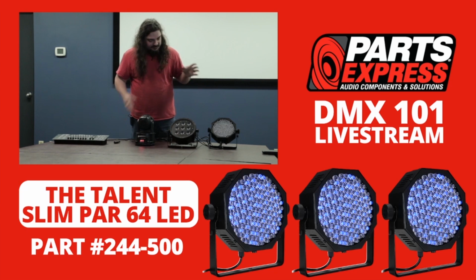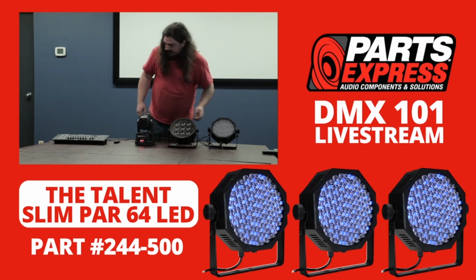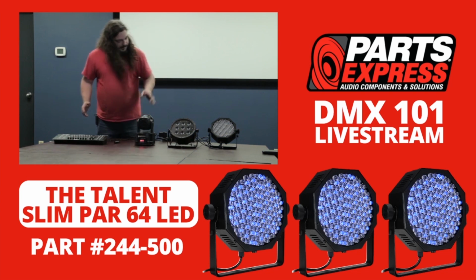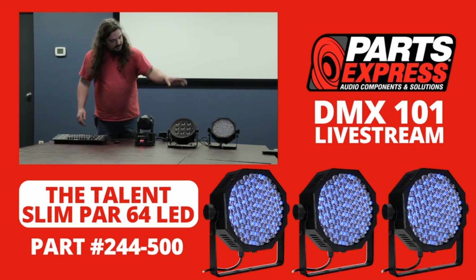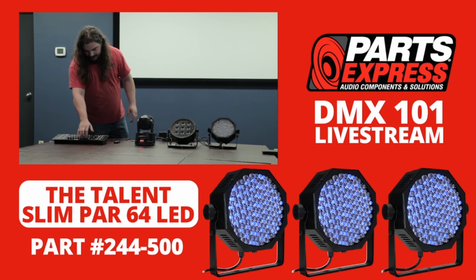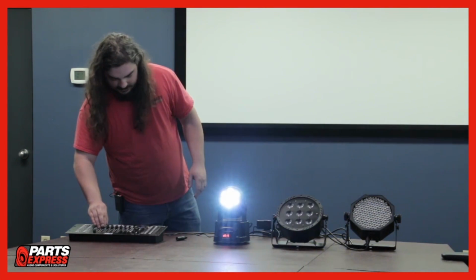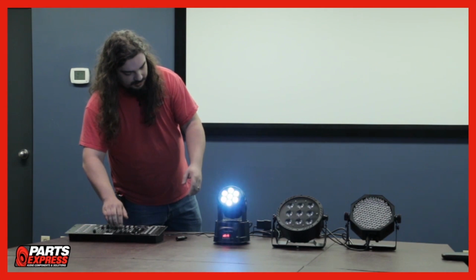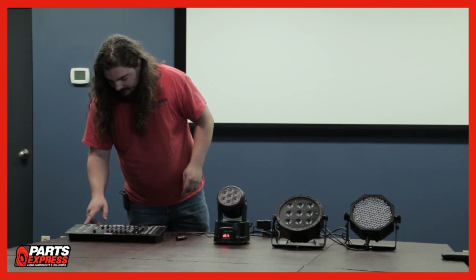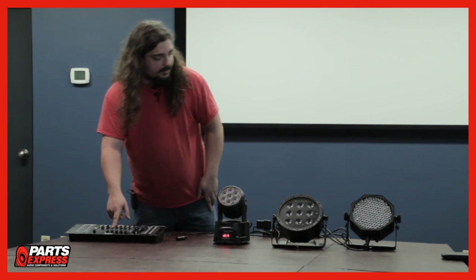Now, what's neat about some of these is that if you have this set, let me change it to three channel mode. So now, it takes nothing. It's just red, green, and blue. What I can do is I want that to line up with the colors on this light, which are over here on the other side of the board, which would be right here, right? Yeah. So I want my red, green, and blue from this light to line up with where they are here. So I've got it in fixture one, which starts at channel one, but the red needs to start at channel four. So I'm going to set this to four.